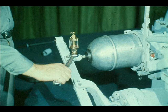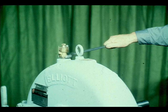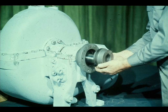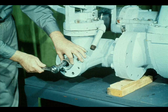Just a few miscellaneous parts remain to be reinstalled. This lubricator must be replaced on the spindle connection. The speed changer assembly also remains to be reinstalled; it is connected to the end of the governor lever and to the outboard bearing housing. Note that some turbines will not be equipped with a speed changer. The sentinel valve must also be replaced on the turbine case. Reinstall the coupling half on the turbine shaft according to plant procedures, and check the coupling for run-out with a dial indicator. Don't forget to reinstall the strainer in the steam inlet body.